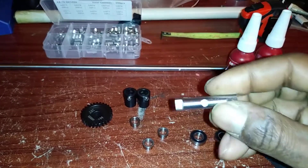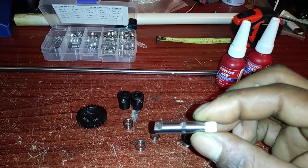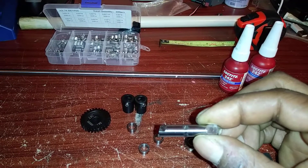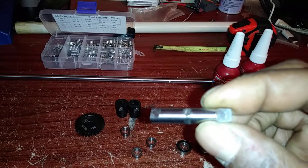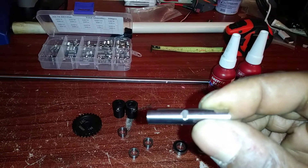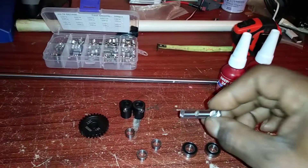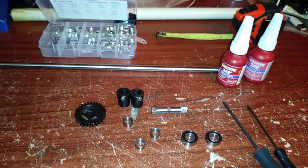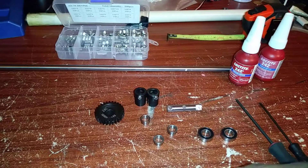This right here is a shaft that I had cut — I only got an inch and a half for my spool. I got my flat spots cut into it for the gear and the cup joints. You want to definitely cut your flat spots nice and deep so the grub screw actually burrows down into it and has a home to sit in.